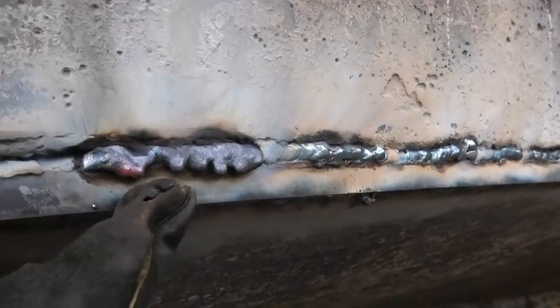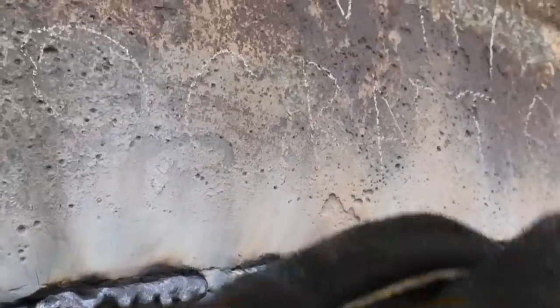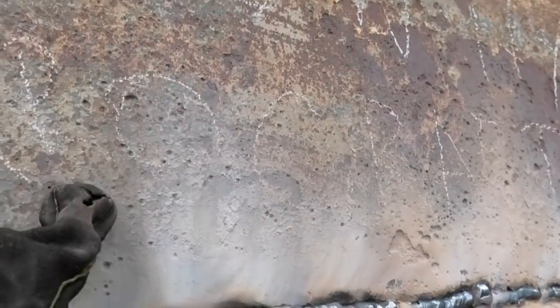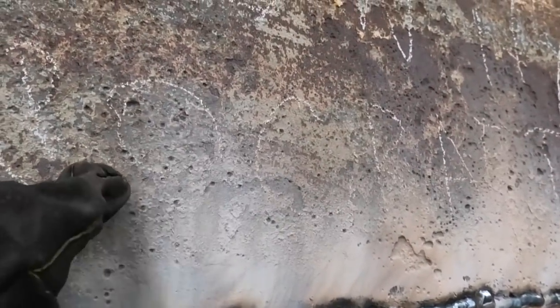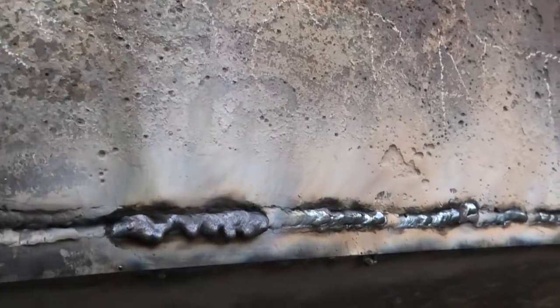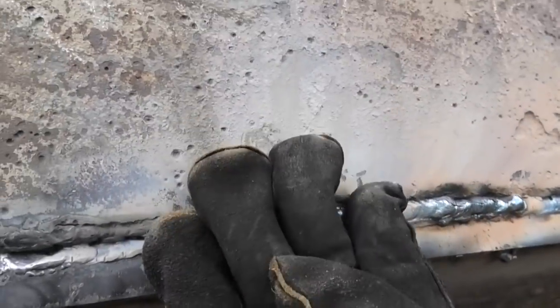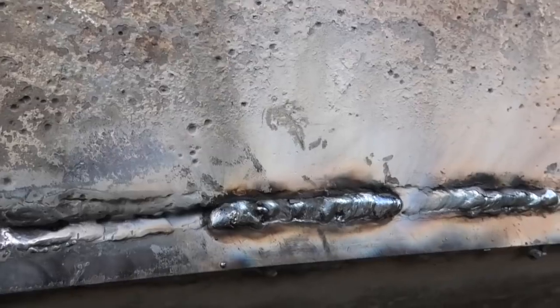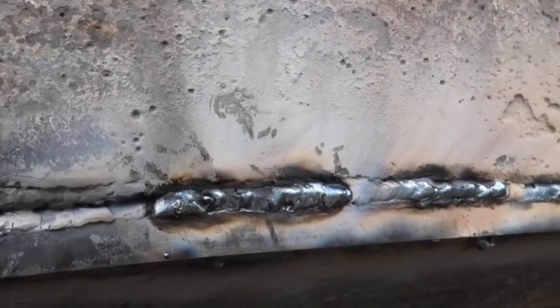This site has been particularly contaminated because of salt and rust, but particularly because of diesel that was trapped behind this doubler — it had come through the hole in the side and then filled in behind the doubler. That's great for corrosion protection but not so good for welding. Often you'll get a bit of hot diesel and as it expands it'll heat up and jet out through the puddle. Makes it a little bit tricky but we'll get there.